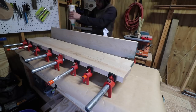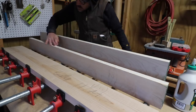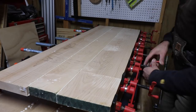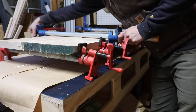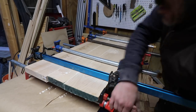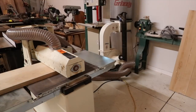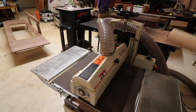I'm just using glue and clamps to put this together — you can use dowels, but I'll show you what I'm using later in the video. After both pieces were dry, I took them over to my friend Todd's furniture shop and used his drum sander to flatten out both pieces.